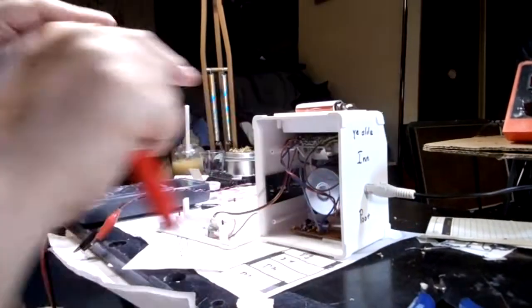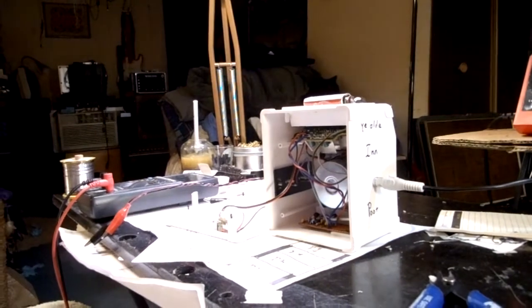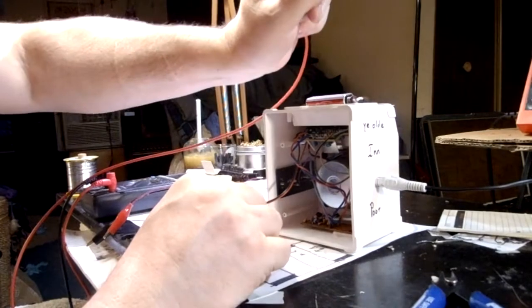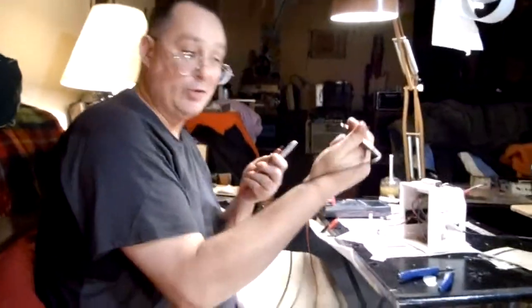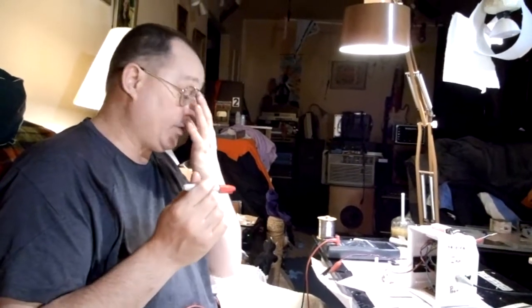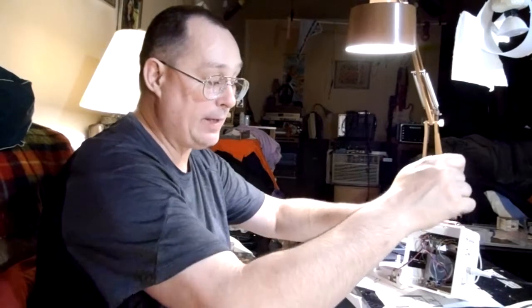Then you know you're going to be able to get 6 volts, positive 6 volts, from that spot on the circuit that you marked red, which beeped when you were touching the red battery pack lead with the switch on. When you shut it off, it should not beep. Then you know. Now another way to do that would be to go right on the switch. You could test this on the switch and see which side of the switch is coming in and which is coming out, and tack your wire on to the output. But the idea was for me to be able to get 6 volts to power the oscillator circuit and to get the input for the amp.